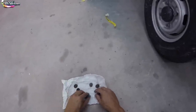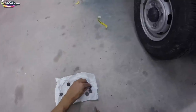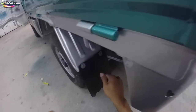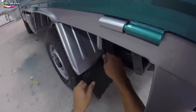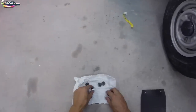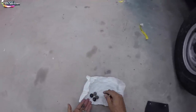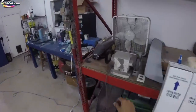After organizing, I decided the nuts and bolts were dirty and ugly, so I'm gonna hit them with a wire wheel quick to get them looking new. This is what you can do to all of your nuts and bolts before putting your new project together — clean them up. You can clean them up and put them on, or clean them up, put them on, and then hit them with a flat black so they're actually painted. You could even paint them first, but then you might have to retouch them because putting them on will expose bare metal again.